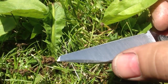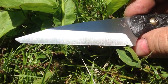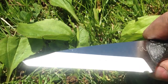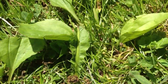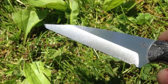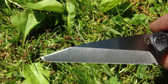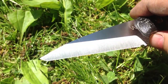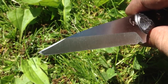The radius swedges come perfectly from the midpoint of the grinds, flat to the tip. I actually like this finish — it's straight-up 120 grit. It looks really cool, very nice contrast between the horizontal grind lines and the regular grind. Look at that shine. It reminds me of what a lot of custom knife makers do — like Hinderer customs, which actually leave this rougher grind on it. It shows the grind line and has a very nice visual effect. It may decrease cutting ability slightly due to resistance in slicing, but that's a minor thing.